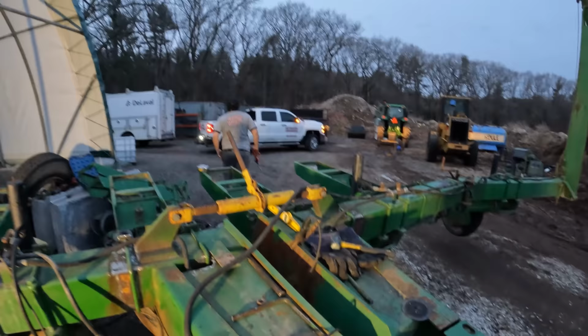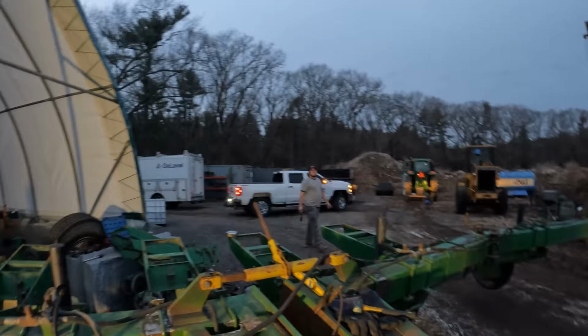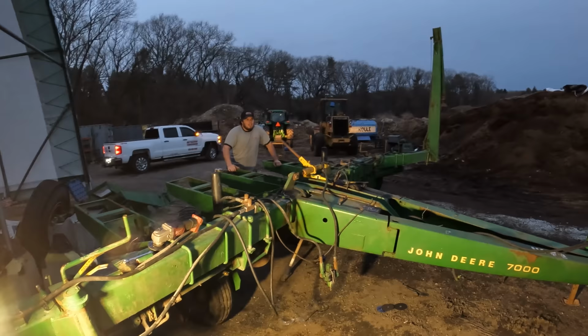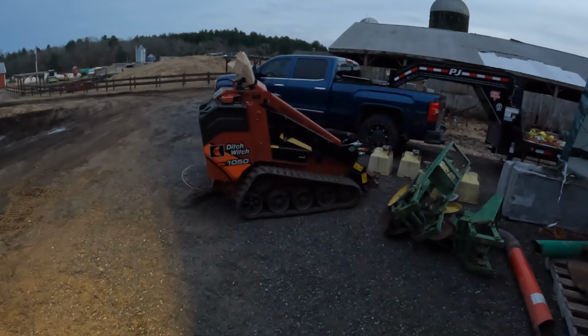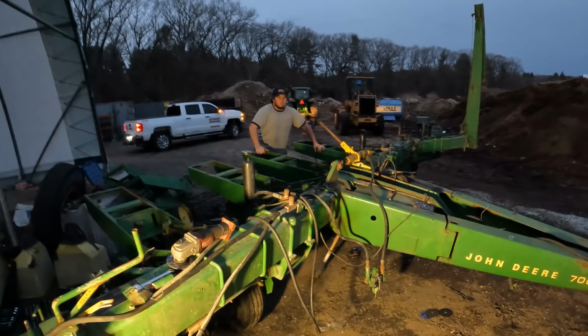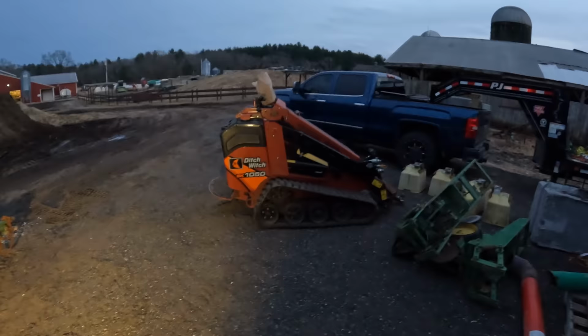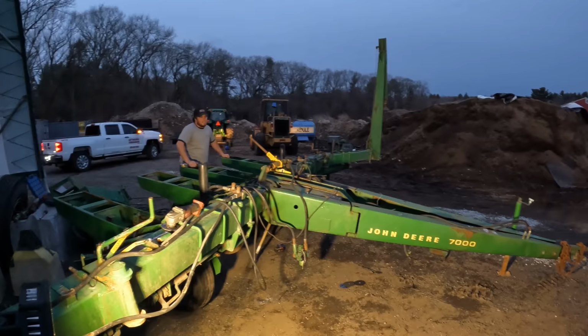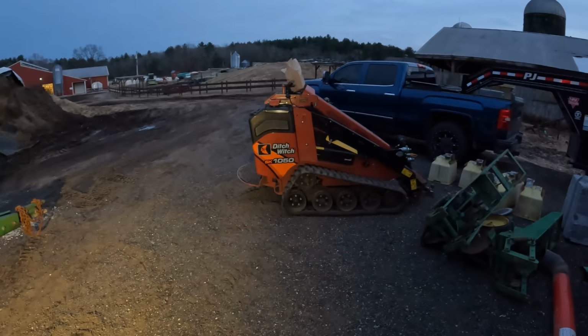But it's taco time. Hey, how much can your Ditch Witch lift? Give us some rundown of the specs. Weighs like 3,500 pounds. It can pick up 1,062 pounds at 35% tip. And at 100% tip, I guess, is 3,000 pounds. And we've had it at 100% tip pretty much. So, it's a good machine, obviously, as you guys have seen. It's handy getting in and off of, so kind of beats the skid, but the price tag on it was pretty much the same as your average skid. That came in at like almost 40 grand, so they are expensive, and you are standing on it out in the conditions, but it's obviously handy.